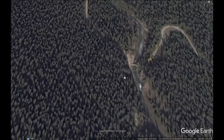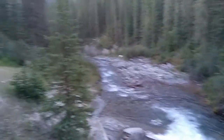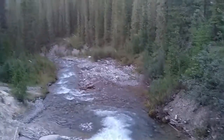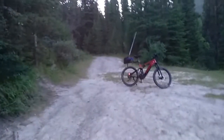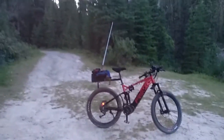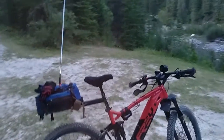So here we are at Goat Creek, about 13 kilometers from the base. What's significant about this location is the elevation — we're down in a hole, in a bit of a canyon. The creek flattens out over here, but I am obstructed by terrain features. From this location, I made one contact out of six without the counterpoise attached. With counterpoise added, I was able to make contact every time, but the signal was about four by three. That's what I'm calling our limit for today.